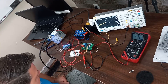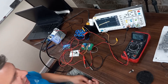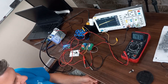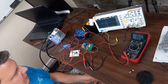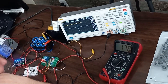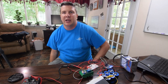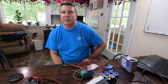The MOSFET probably needs a heat sink. I'm going to turn the current down a little bit. We've probably come to the stage here where it's just going to be continually on and the current is just going to continually drop because we're in that bottom half of the curve. Down to 1.2 amps - yep, does what we want. Most of the time when we're operating this we're going to be in that upper range, but when we do the initial charging we're going to have to be careful and use a charging system just like this.